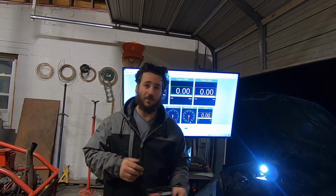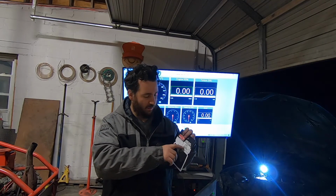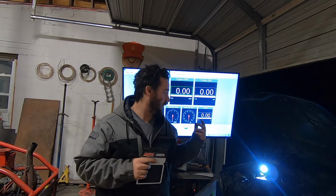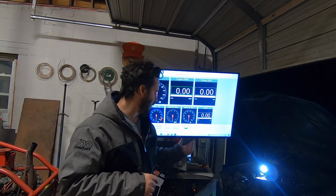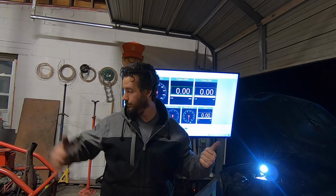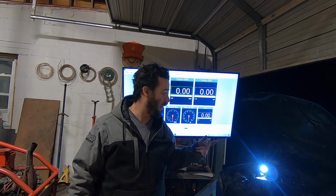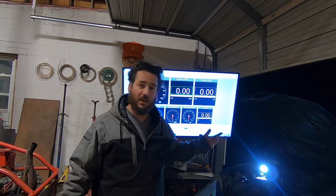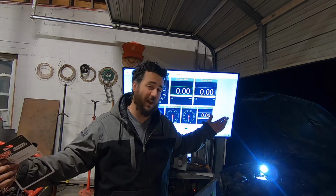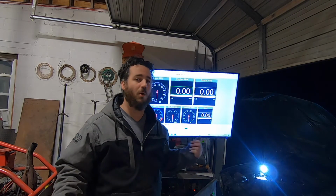This was interesting, kind of went a little differently than I expected it to, but it went great all in all. So it's the MSD 8918 Universal Tach Pickup. Use it for your dyno, $5 opto isolator from SparkFun or whatever that website is. I ran it on an old school 67 Volkswagen, a 2000 BMW, a 2001 Chevy Duramax, and an 86 Chevy K5 Blazer. So I got 4 different ignition systems. One of those motors doesn't even have an ignition system, it's a diesel. And it worked to pick up the RPM on all 4 of them with no hardware changes.